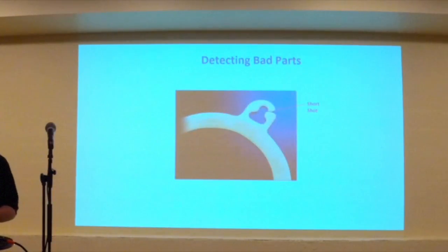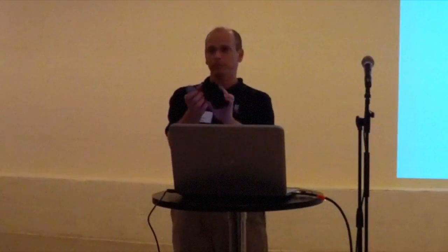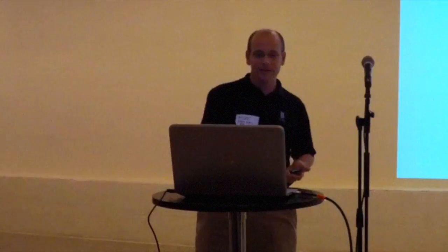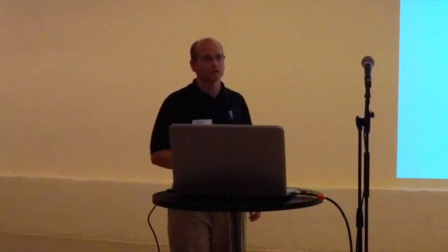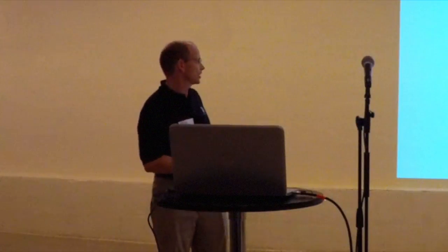There are a number of processing-related defects. This is the cardinal sin of injection molding — it's sending a short shot, an unfilled part, to your customer. Imagine if your iPhone case had a little piece missing from the corner — that's a serious problem. It costs molders thousands and thousands of dollars every year just to resolve these problems.